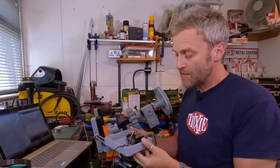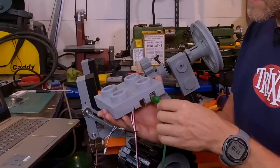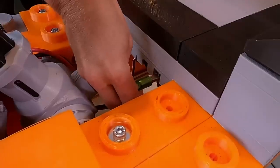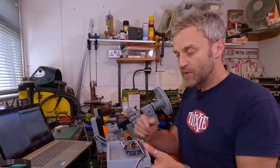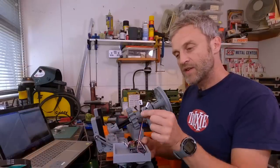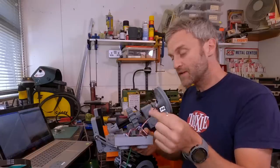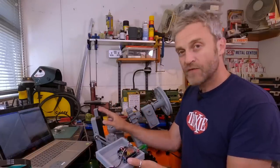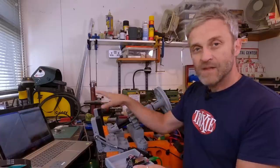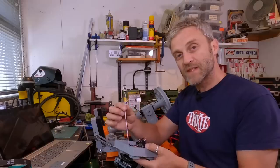Here's the Arduino mounted into a 2x2 Lego plate. This is going to go under the seat and so I can get to the USB port to make any code updates. I've got the accelerator and brake plugged into two of the analog inputs, and I've got an RC output going back to the VESC and also a serial input output going back to the VESC. Right now the code's very simple. It's reading the two input values from the accelerator and brake, and it takes a minimum and maximum value. It then uses those values to scale the inputs to the correct output data for the VESC.